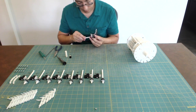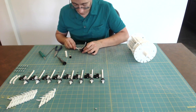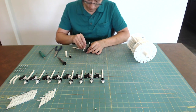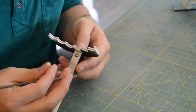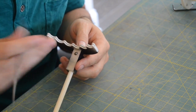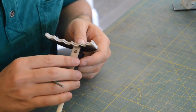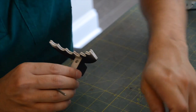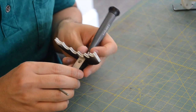The reversing lever is assembled by placing the axle into the bottom of the lever handle, to just below the hole in the back side. Drop a spring from a cheap ballpoint pen into the hole and place a 6 mm ball on top. Slide a tool in the top of the reversing lever to prevent the ball from popping out of the top, and then use another tool to plunge the ball as far as it will go.